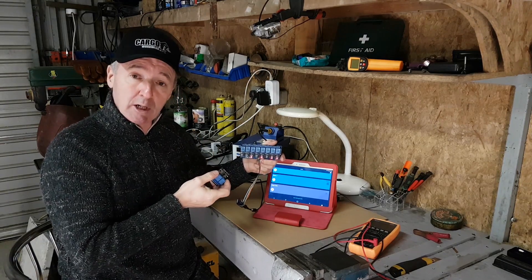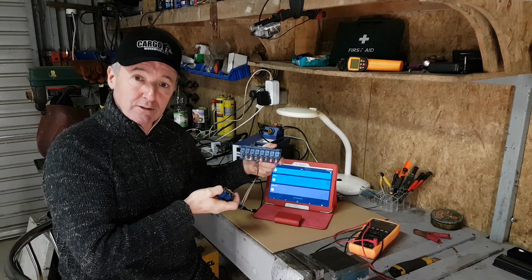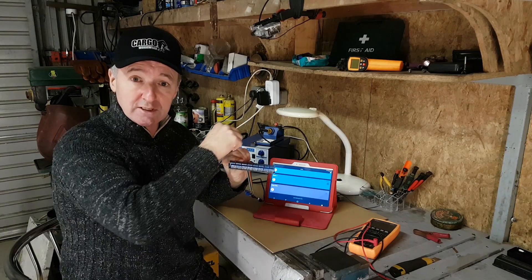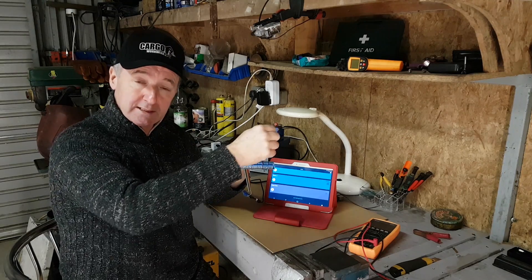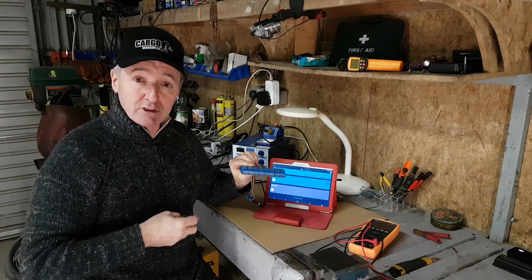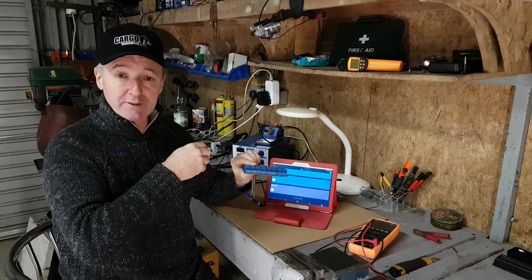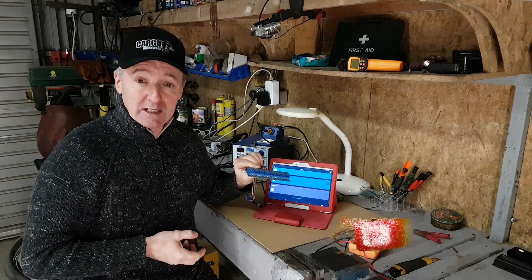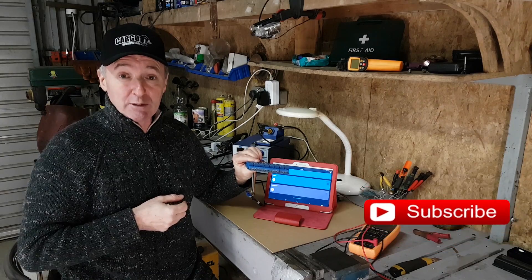So I'm going to connect this all up to my heating system tomorrow. I just need to get some boxes. I can't do it now, but we're set up and ready to go — this just needs to go into a box. Then on the high-voltage side of these relays, I've worked on the low-voltage side earlier and soldered all that up. The high-voltage side gets 220 volts in this country, it gets looped across, and each relay can switch on an individual item. In the description below I'll leave the sketch I used for this D1 Mini — links and all that — whatever I can do to help. Maybe I'll do another video on programming this in the future. If you like the video, please thumbs up and subscribe. Thanks very much — see you in the next video, bye for now, good luck.